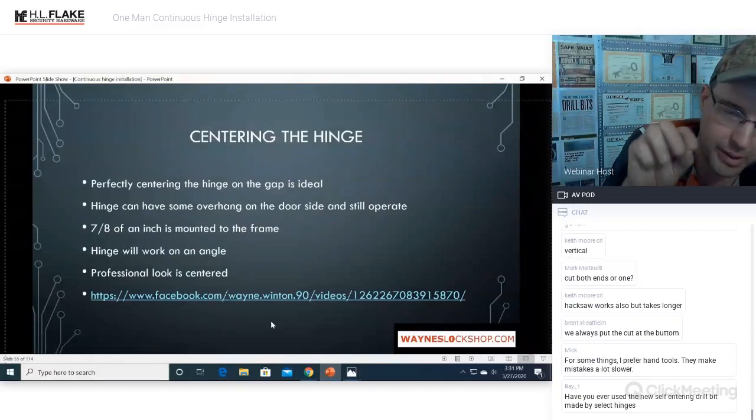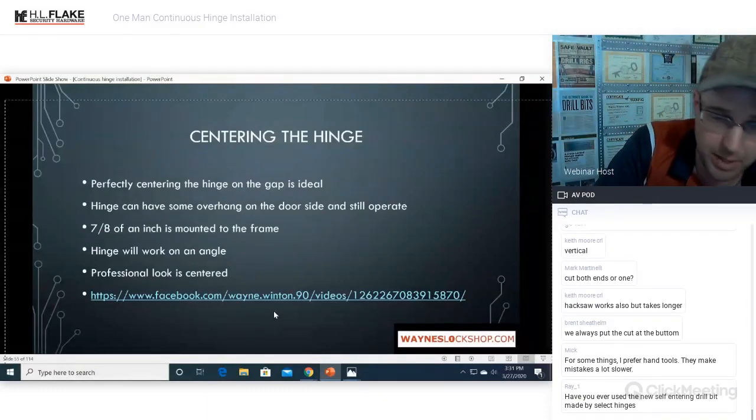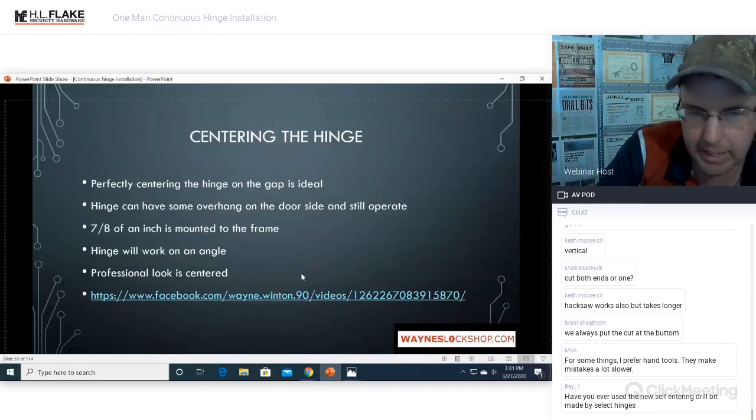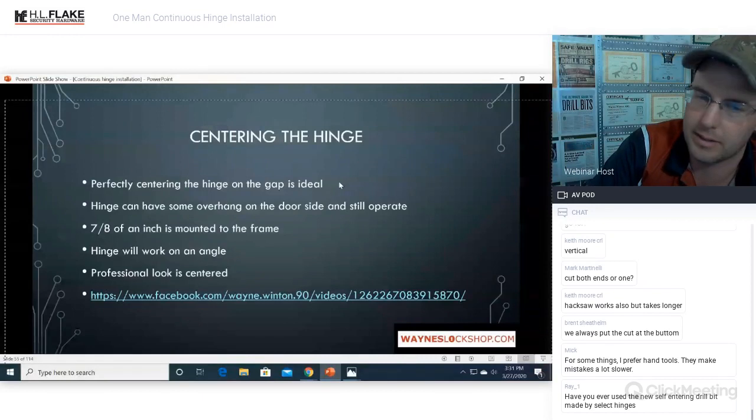It's got a small, like a 1/8 inch point, and then it expands out to 3/8. It works great on steel and aluminum. Aluminum kind of tends to get a little melty, but anything thicker than that particular tip of that bit just starts to gum up quickly as soon as you get into wood. The step bit's by far the fastest that I've found.